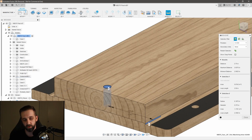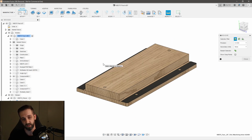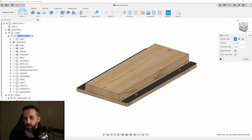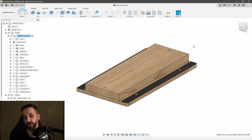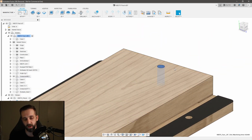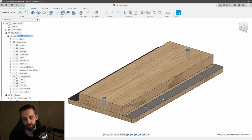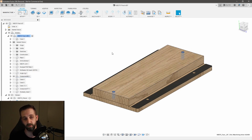Now these dowel pins, I will show you these in a moment, but essentially those are obviously so that I can flip the part. But when the stock is sitting on the fixture at this point, there's no dowel pins. It's just a square chunk of wood or rectangle chunk of wood. I get it roughly in alignment as close as I can get it, and then just clamp it down. And by modeling the stock this way, rather than what I did in the previous episode where I had Fusion create a stock for me, I was able to model in these dowel holes so that I would be able to machine those, and I didn't have to include those in my part. This is just for setting up for the flip, but I didn't actually have to include that geometry in my part whatsoever. I just built that right into the stock.